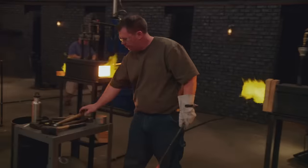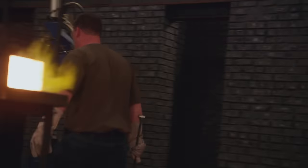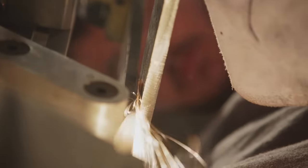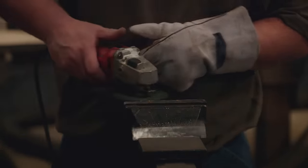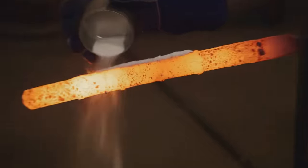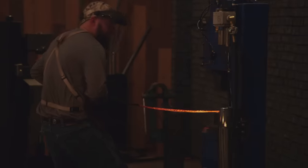I picked the steel off the leg curl to get a good piece of hardenable steel. I'll try to get the blade shaped out first, then add the secondary piece into it. If my forge welding skills were a little better, I'd try a san mai or a taco or something like that, but I'm going to play it safe. I have to lose some meat off of this, grind it to shape, and heat treat it. Rex is really getting that blade ground down to a fine look. I'm going to use a piece of mild steel from the frame for the handle. Being that the test is plate chop, I'm putting the mild steel in the handle so that when it takes that big jolt, it doesn't shake loose or come apart. I use the san mai technique so that the outer shell of the blade is a little bit softer and can absorb some of the shock when it smashes into that weight.